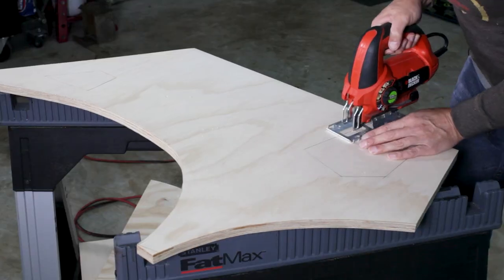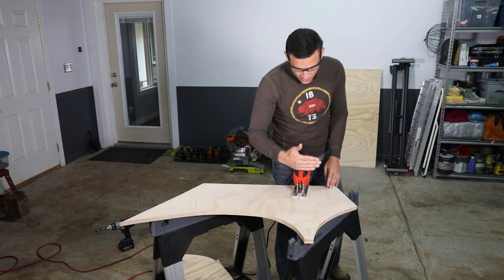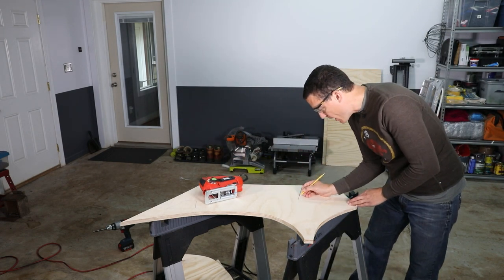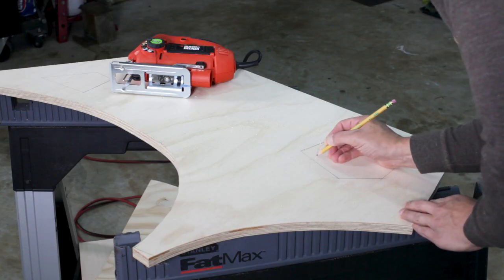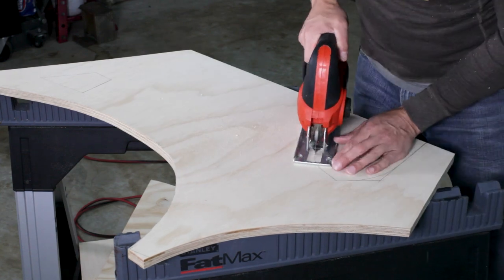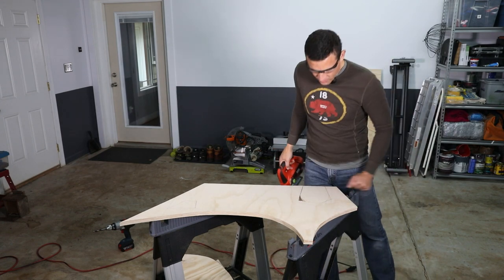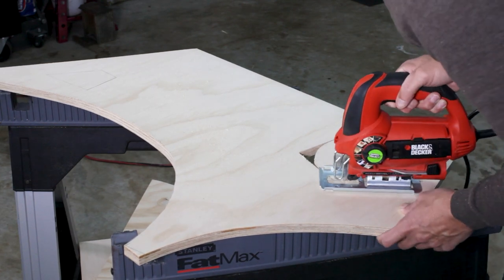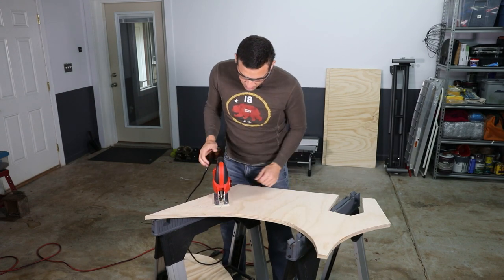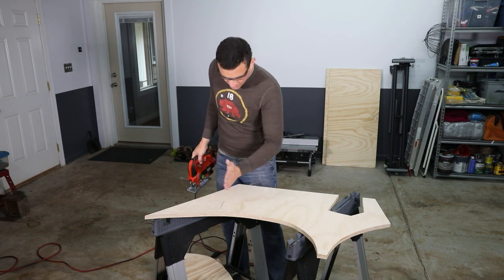This is what the house is going to look like. With the jigsaw, when you want to make a corner, it's not possible to just get to it and turn. What you have to do is go straight, come back, then make a nice curve, continue to finish, turn it around and go back this way. Wait for the blade to stop completely before you take it out and go back. Now I have a straight line and it's big enough to drop the blade through and follow the curve.